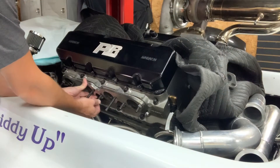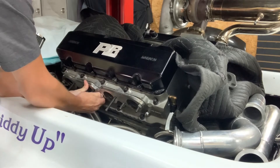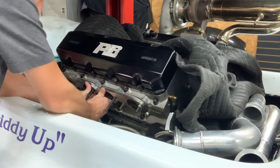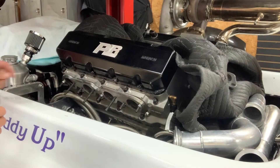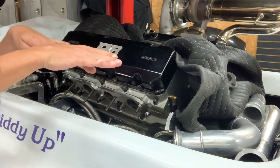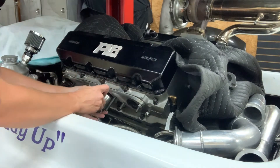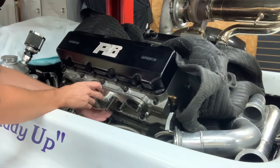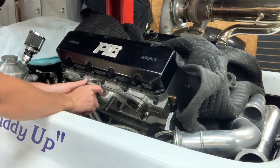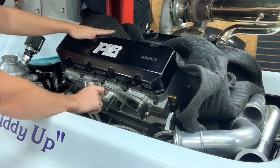We have the head flange sitting on here - this flange looks like it may be a little tweaked out, so we're going to throw another nut on it trying to get it nice and true up against the gasket. These gaskets are so thick, I'm going to leave them on during fitment. Since the heads are offset from each other by the thickness of a connecting rod, this head is sitting forward farther than that one. I'm going to shoot this head back just about half the thickness of a connecting rod. I'm going to use the valve cover as my level because the boat's sitting on the trailer and probably leaning back.